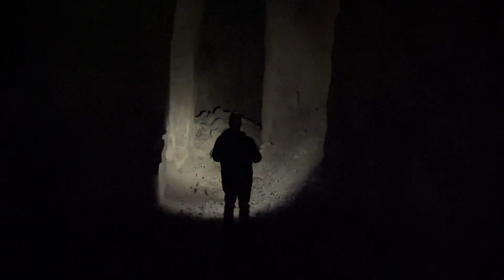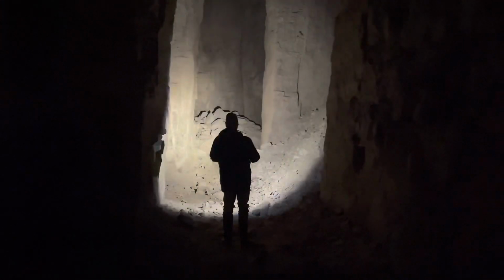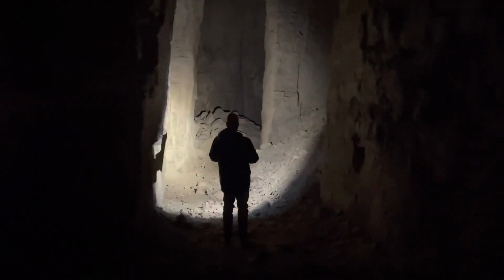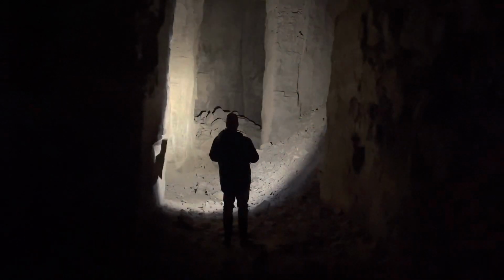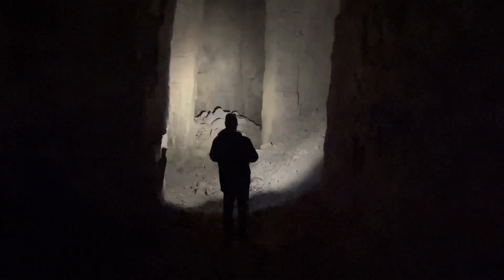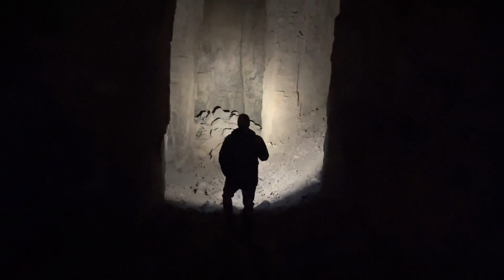Then I will go into the normal sequence. So the highest mode with 440 lumen for around 240 minutes. Then it will dim down to 230 lumen for 50 minutes. In this mode I measured 400 lumen. Then we have the medium 2 with 40 lumen where I measured 38. And the medium 1 with 160 lumen where I measured 150 lumen. So the output indications are quite correct.